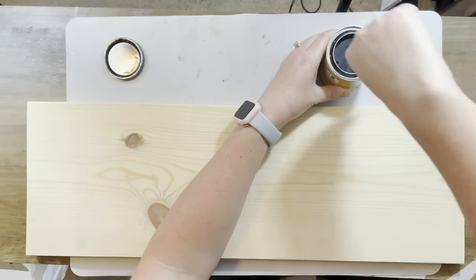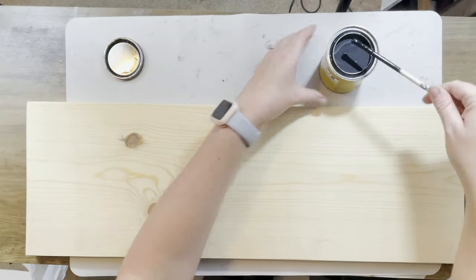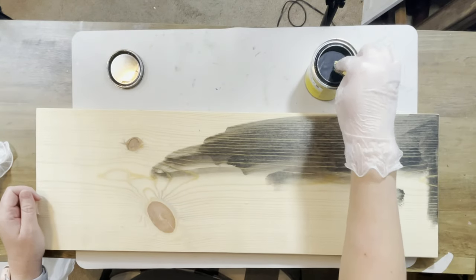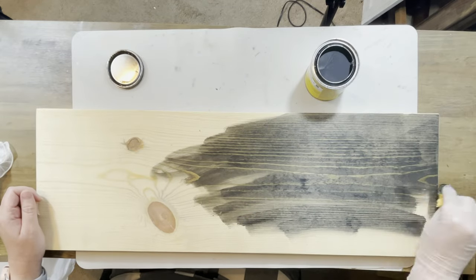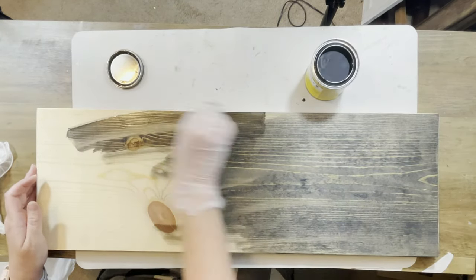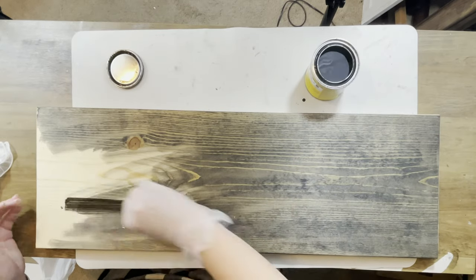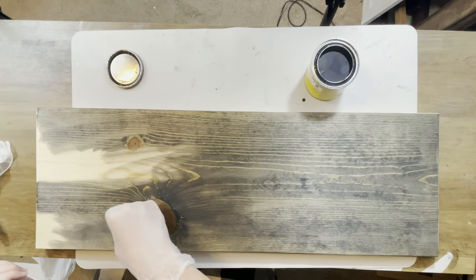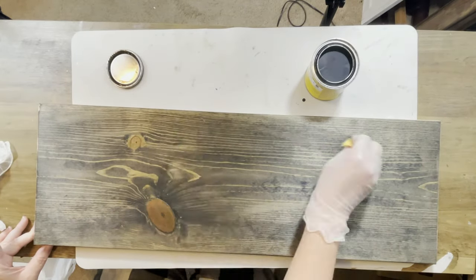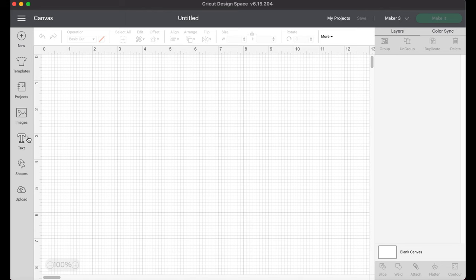A black stain isn't something I would normally think of for Christmas - I usually think of rustic woods. I've got a glove on and I'm just taking a little piece of microfiber cloth, dipping it in and applying my stain. That's a Unicorn Dust design tip I picked up from Sammy. I had already sanded this board down to about 320 grit sandpaper, and I also sand down all my corners and edges to give them a more rounded finished look. I apply the stain on both sides.